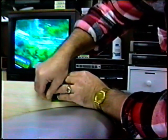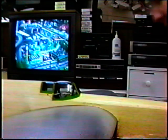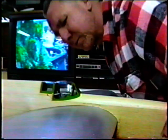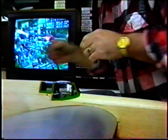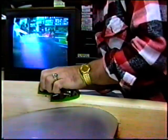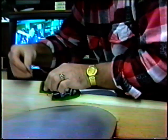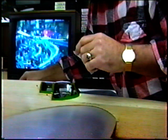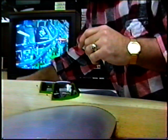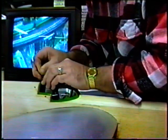Now I'm just making sure when I put the first two pins in that I have real good alignment, looking from the front, from the side, making sure nothing dripped and drooled inside. Everything looks okay. Now I want to start the four corners in the back. Because this wood has been hardened up with CA, you have a real good grip on it. And these pinholes allow the epoxy to sit right in there and make like little nails, rivets, whatever you want to call them. And of course, I guess the most important one, the one right on the top.